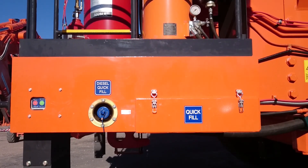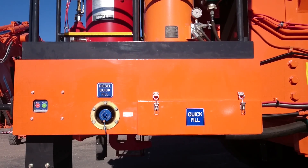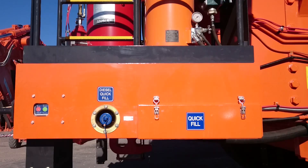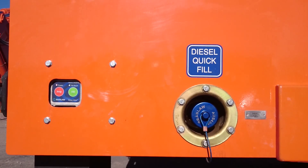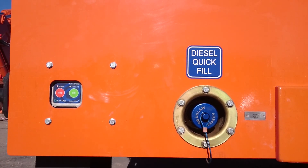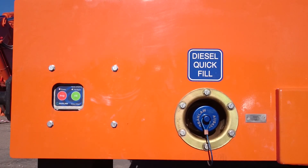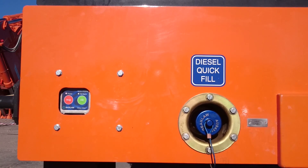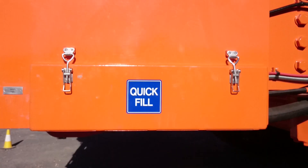Front bumper refuelling for limited truck movement on the go line while fuelling. The fuelling receiver is a 1000 litre a minute BRM43L, which allows for 1000 litres a minute with limited nozzle restrictions due to light spring.